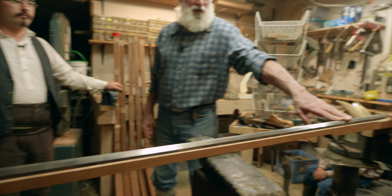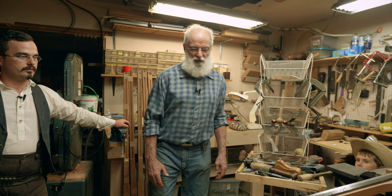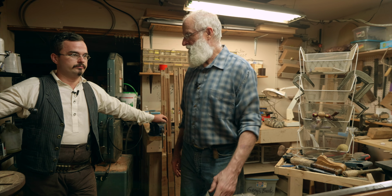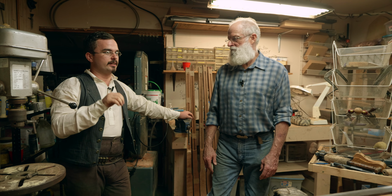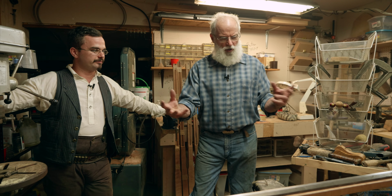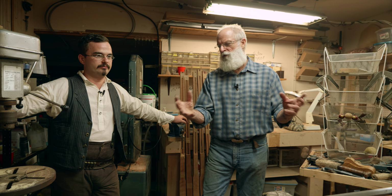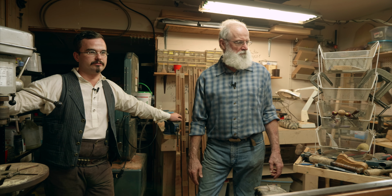And so this rifle on the bench is a work in process. You can see I've got the barrel in, the tang is in, the ramrod channel's cut. I've taken some wood off of the sides. I'm getting ready to drill the underlug pins. And then after that, a very specific process of this part, and then this part, and then this part. After all the parts are put on the wood, then you start doing the shaping, the architecture around all the parts. The parts give you a guide to where you want to take the wood off. Very cool.